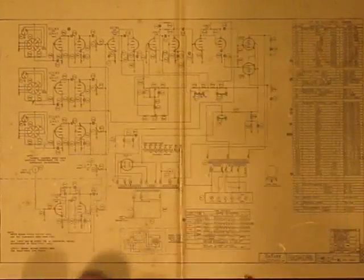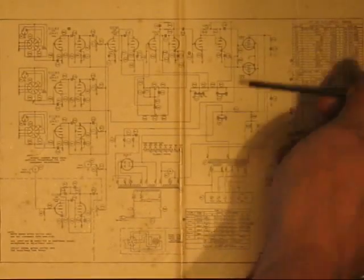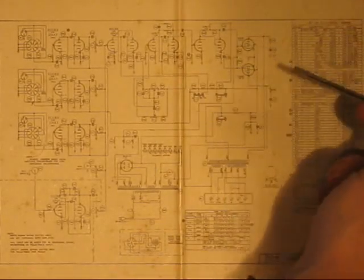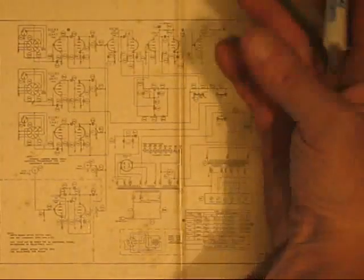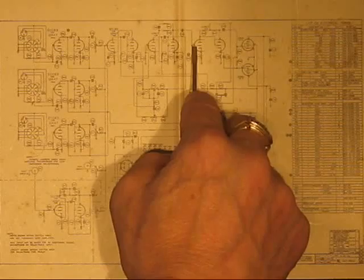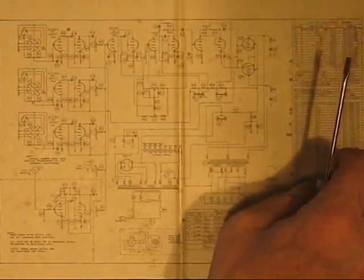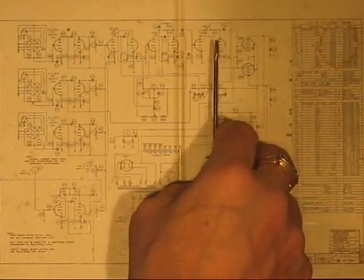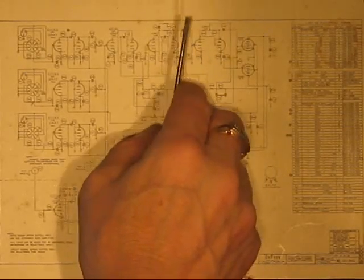I did consider using the other half of the modulator in this circuit that's not currently being used, maybe make a cathode follower to increase the brightness of the neon. Why do all that? I want to have that spare triode for something I'm going to attempt later on. So I moved back a stage, tied to this grid, an improvement, but still the depth of the modulation was just not satisfactory without doing any modifications on the oscillator circuit. So I moved back one more stage, and that's definitely adequate.